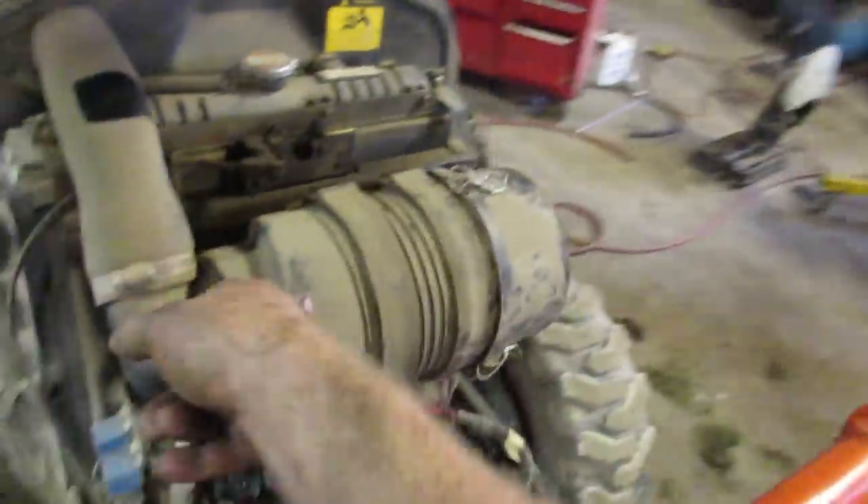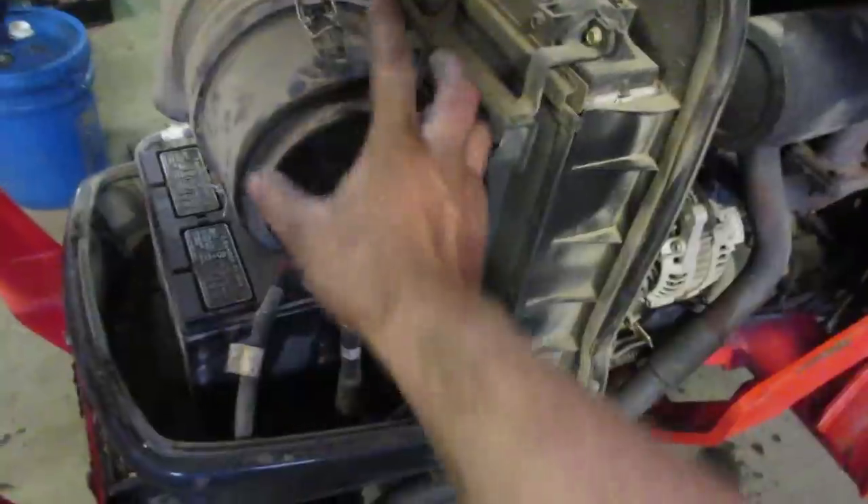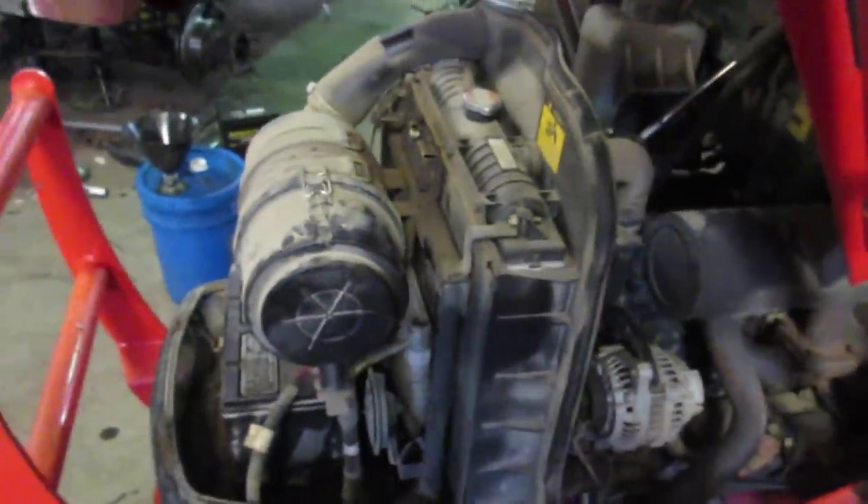There's an oil cooler and air filter — pop it off and blow it out. Don't get too concerned about a dusty filter; change it every thousand hours unless you're in extremely dirty conditions. There's also a block heater because it gets cold up here in the great white north.